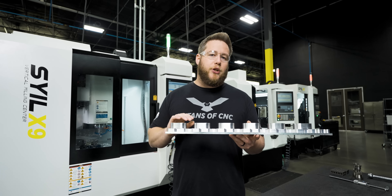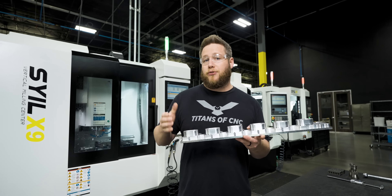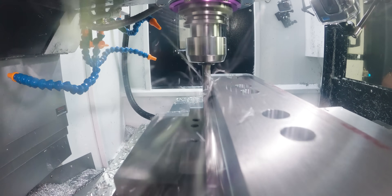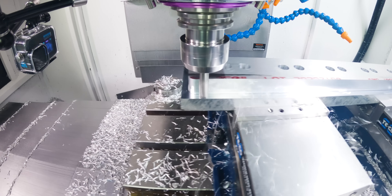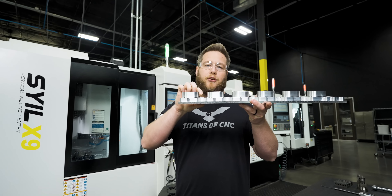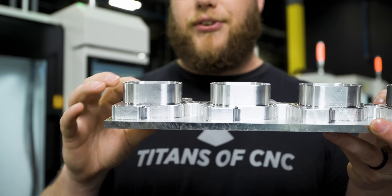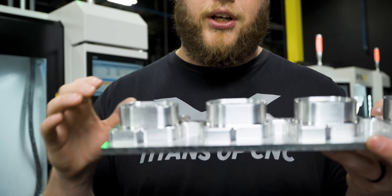So I got to thinking that maybe I could do this in two different steps rather than one and speed the process up because the machine isn't having to slow down as much. On top of that, when going full depth I had to slow the feed rate down to 240 inches a minute. So the first depth you're seeing it cut to is basically right above this floor — the floor is 875 thou deep and I'm leaving 15 thou stock on it, so that's 860 deep plus 100 thou on top, roughly 950–960 thou deep.